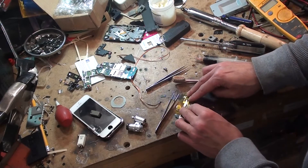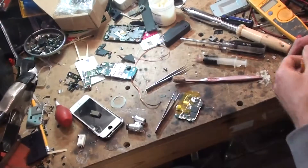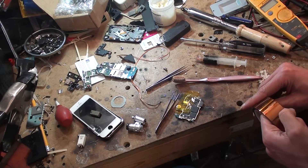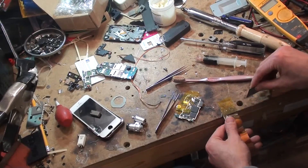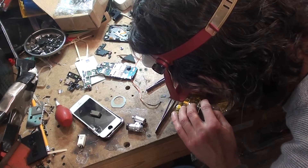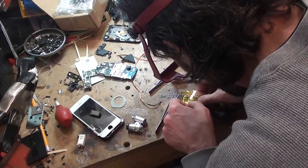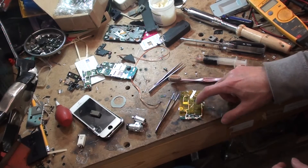You don't have to use it if you don't have it, but if you do have it, it would help. I've seen other people also put pieces of metal around the opening of the IC just so when you apply your hot air it's not blowing off a bunch of the SMDs — chips and resistors that you have in here. SMDs are surface mount components, which are the little tiny things. So basically a little bit of Kapton tape on the edges here.